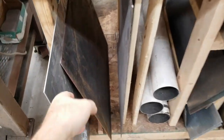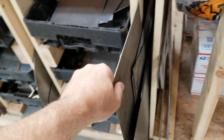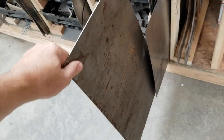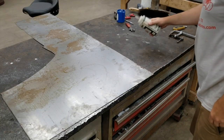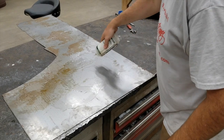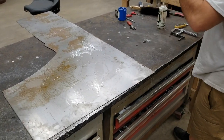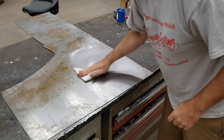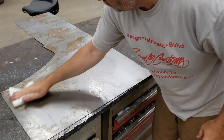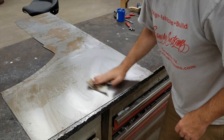This piece is going to be 18 inches wide and we should be able to grab an offcut of some 16 gauge cold rolled to use for this. One of the things I'm going to do is, because I'm using a Scotch-Brite for the engine turning, I want to make sure this is really clean. This 16 gauge cold roll comes with a lot of oil on top, and once it's been cut and got plasma water mixed in with the oil, it's a pretty messy concoction. So I'm just going to wipe it all down with some lacquer thinner and get it clean before we do our initial cut.